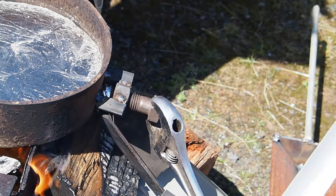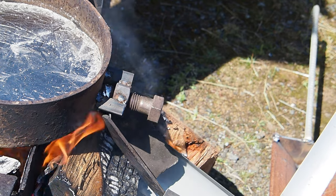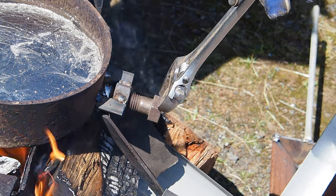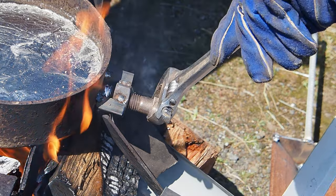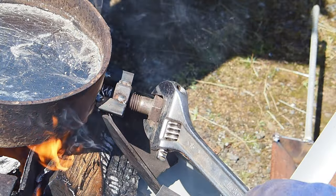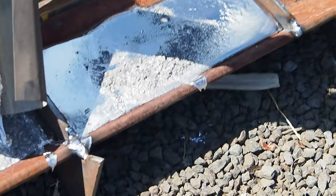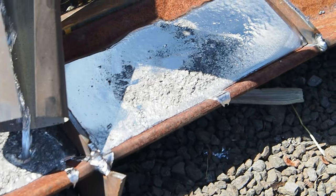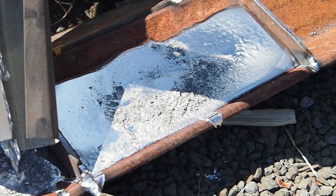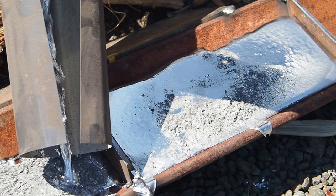It's a very satisfying thing to do, and we had to tinker around quite a bit. The first setup we used an incinerator and couldn't get enough heat into it. So in the end I used my old childhood steam engine experience of lighting a fire around the boiler to get it all up so it started to pour. You get a fair bit of fluffy stuff comes through — I learnt you should re-scrape that off, but you can hit it with a hammer afterwards and it flattens down nicely.